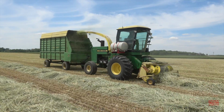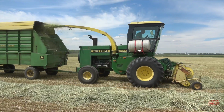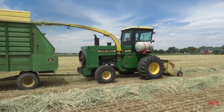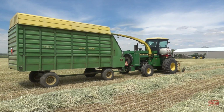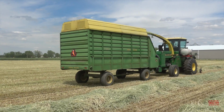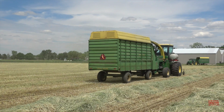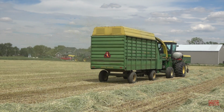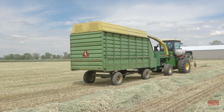The 716A can be mounted on a John Deere 1075 four-wheel wagon that will hold up to 20,000 pounds, or a John Deere 1275 six-wheel wagon that will hold up to 24,000 pounds. This steel-sided forage box was manufactured for 8 years with wooden floors and then upgraded for its last 2 years of production to poly floors for easier unloading. It requires a 540 RPM PTO tractor to unload silage and had an original price tag of $11,000 when it was new.